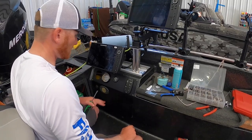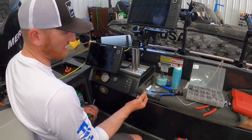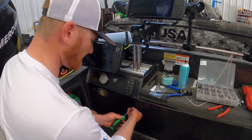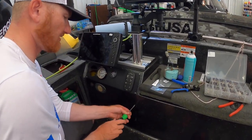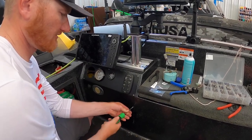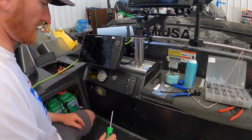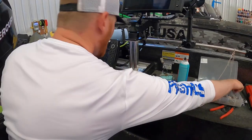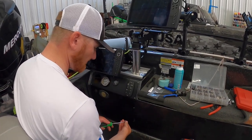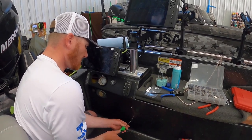We drilled this with a very small drill bit and we're using a small number eight screw because we can always go bigger in case it loosens up. We're putting these in by hand so we don't tear anything up — you can see it's pretty firm, it's sucking it right in there. It's very solid. Simple little thing, just takes a minute or two. It'll look a whole lot nicer, you won't have that gap, it'll be nice and tight. Sometimes these projects don't require that much time or money.